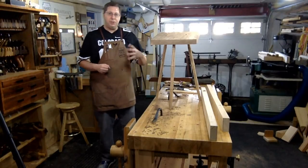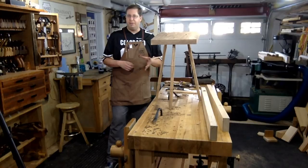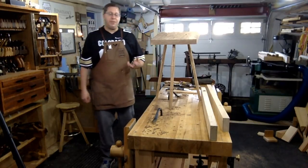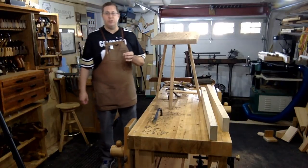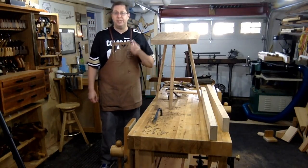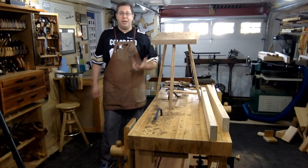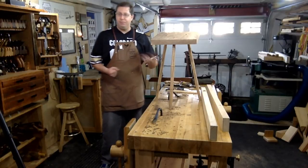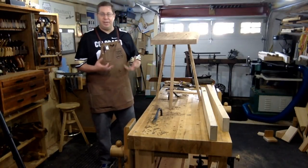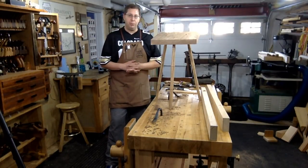Same thing with a leg. With those wide open pores, it's going to look a little rough no matter what you do. You almost have to pore fill your legs. So you want to skip that by using a smaller diffuse porous wood. Most Windsor chair makers are going to use maple. Maple's super hard. It's going to hold the fine details of a baluster leg, but it's also going to give you a nice smooth surface. Let's face it, Windsor chairs are generally painted, but when painted, it's not going to give you that grainy look because of those wide open pores and those ordered rows of pores.